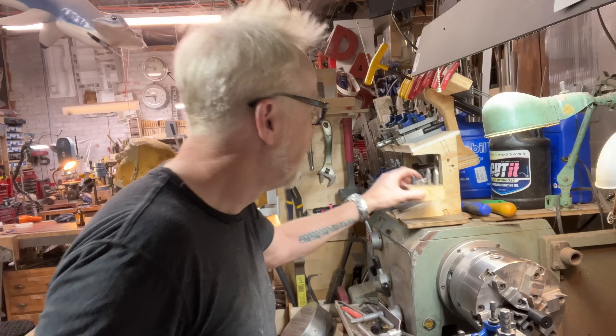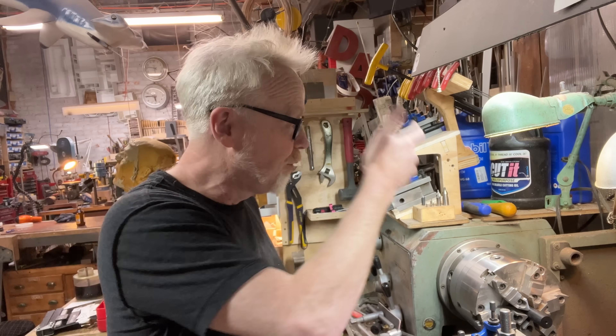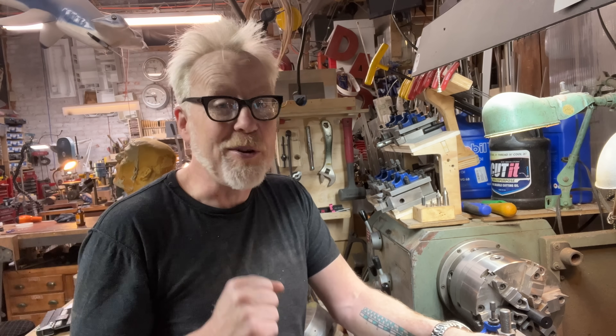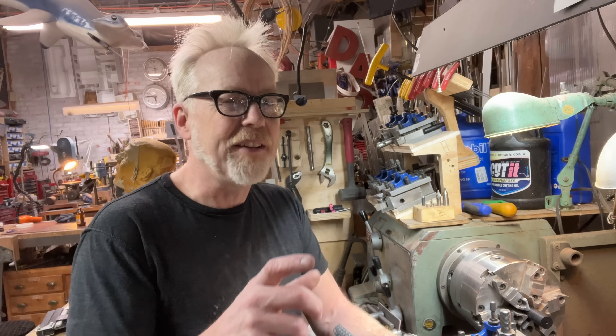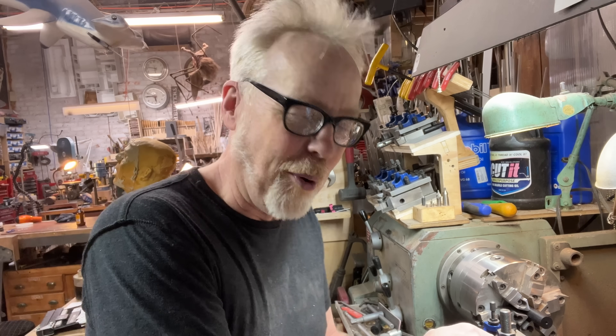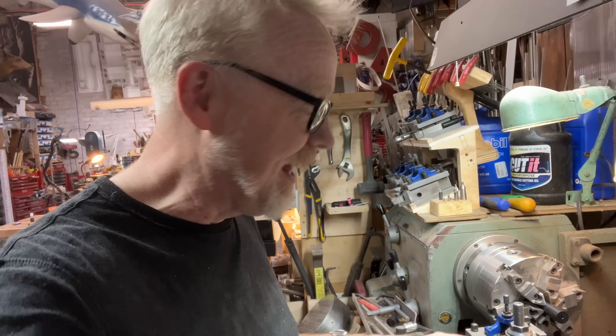But for anything mechanical or repeatable, I always use them — hence the reason they are always right here at the ready. Center drills are fantastic things. They're like that little extra step that makes things just better. You could work for days on end not using them and might not notice, but if you do use them you're running a lot of future complications off at the pass. I've had things that weren't properly center-drilled by the smallest amount and it caused parts to bind mechanically in ways that were very hard to ferret out. Thank you so much for that excellent question, Moultrie Manic Mechanic — I hope you feel more confident that I am using the lathe as properly as I might. I'll see you guys next time, thanks.